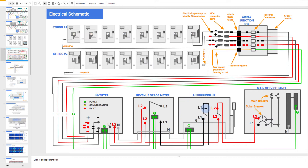The wiring comes in from the revenue grade meter and then goes on to the main service panel. The main service panel came with the house — we don't install that, and it also came with its own main breaker, which we don't install either. What we get to install is the solar breaker. It's a two pole breaker for L1 and L2 — a 240 volt breaker that we're going to install in the house to handle the solar circuit. Now, notice that the L1 and L2 go into the main service panel on the top. That's important because when you flip the switch, the top wires in any big switch like this always stay hot. It's the bottom part wires that are disconnected and go dead. The utility is typically always hot, and the wires inside the switch, even if you turn the switch off, remain dangerously hot because they're directly connected to the utility. The only way to make that safe would be to turn off the solar breaker, which is what you'd do if you're doing troubleshooting.